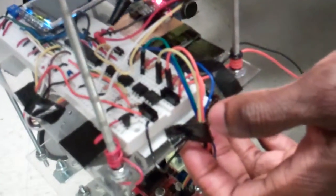You got it. Yes. And one thing to notice is that the resistors connected to the port pins are different. These two resistors are the same, and these two resistors are the same. You had to do that to get the turn-ons to be reliable. This was mainly because the wheels had different RPMs. They were not the same as we thought, and to mitigate that problem, we had to change the resistors to control the speed. Because you'd think with a PWM system it would either be on or off, but there must have been a little bit of analog effect there. If the motors were spinning without any load, it was pretty clear that one motor was spinning slightly faster than the other one. Changing the resistors fixed that, at least for it to work with this. Interesting. I have no idea why.